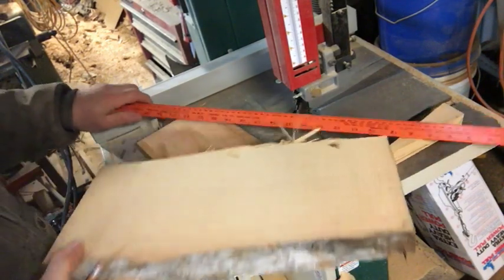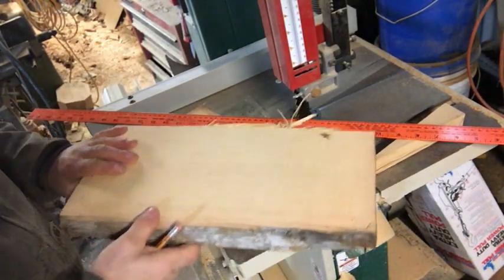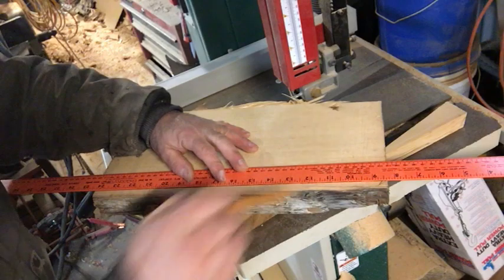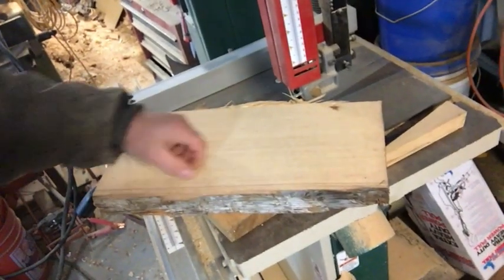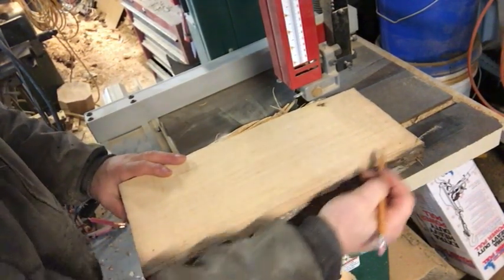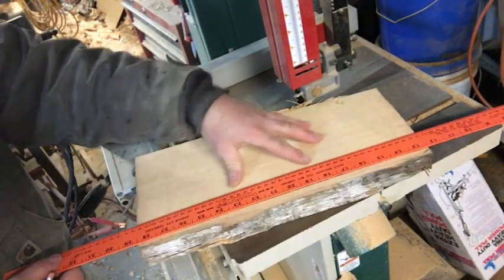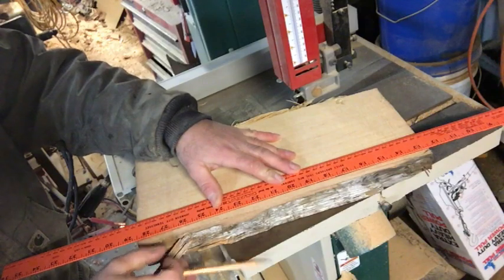Let's say we started out with an edge that looks like this - some fir that I had, I just cut slabs off on the mill. Let's say you have a piece of wood with a rough edge like this. I go take a straight edge and just make a mark right along that edge to where it's going to have clean wood on the inside. Then I can take it through the bandsaw and cut this off straight - after I run this through the thickness planer and make sure it's nice and smooth, I can run right along that edge avoiding all the breaks and splits.